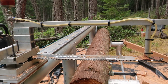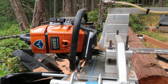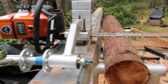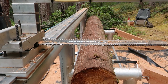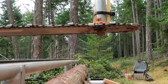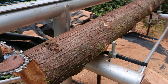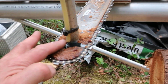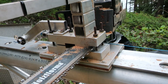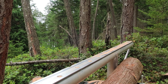A 36-inch bar has quite a bit of droop in it, and that really helps rectify that. This way the saw — with undoing a few clamping bolts — can come out and be used as a regular saw. This is a ripping chain. This is the Holzforma knock-off Stihl 660 and so far I've been happy with it — I wouldn't have it as a falling saw in the bush. That's the only hole we had to drill and put in there to support it, and that way it doesn't actually pinch the sprocket, so that solves that problem. The pulling line just runs up the guide rail and pins in at the end so it takes like one second to undo it.